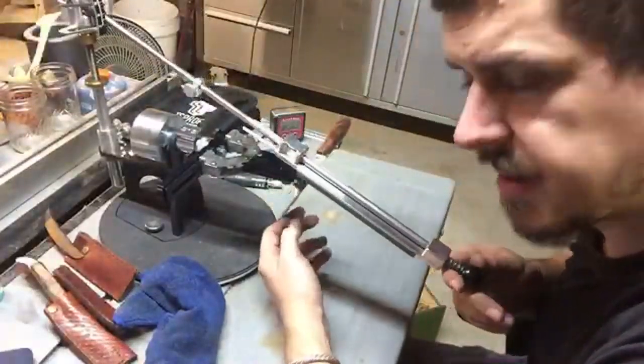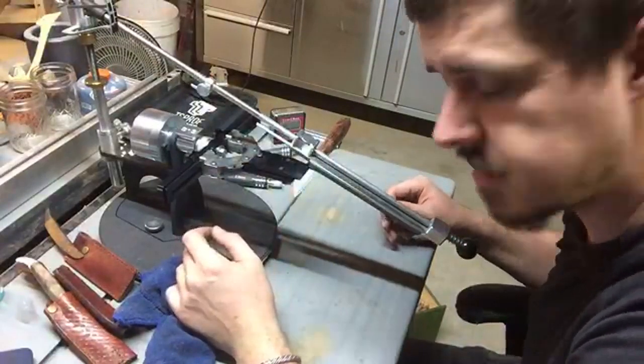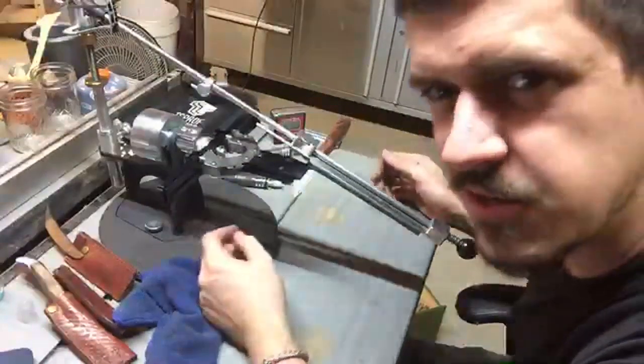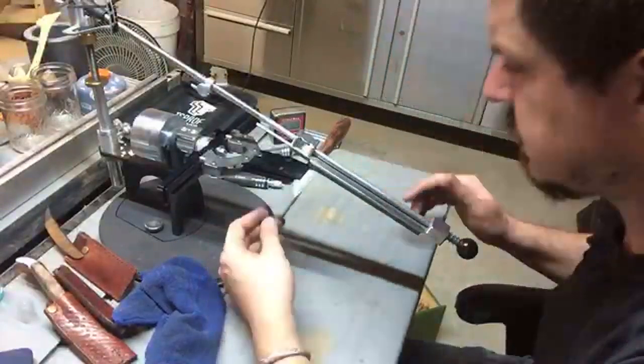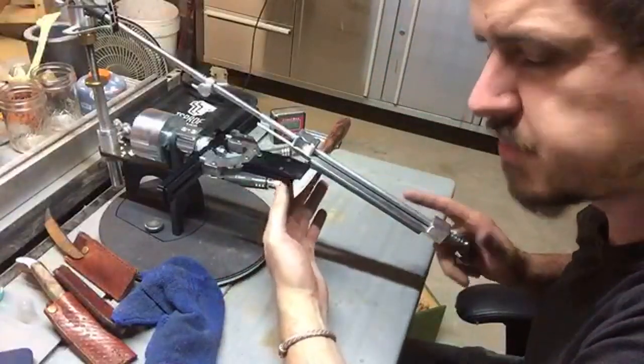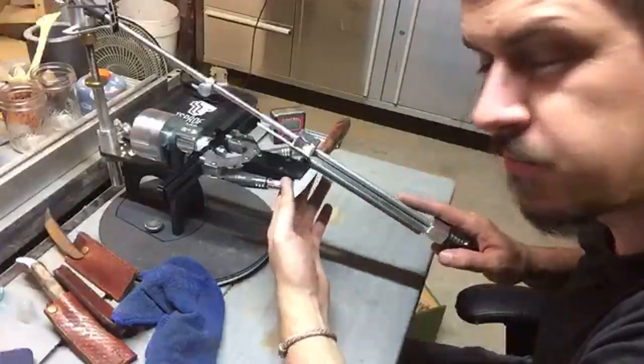It all comes down to what I make the knives for, really. My little neck knives have closer to a 13 degree bevel, because they're just used for opening packages and things like that. They're not really ever going to go under stress. But wood, particularly for whittling and fire sticks and things, just really pounds through blades.